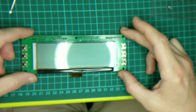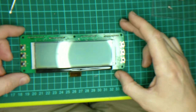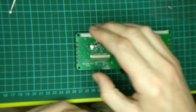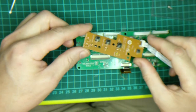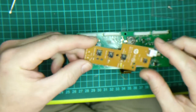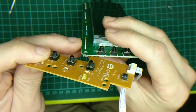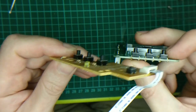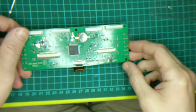So the screen is normally this way up, so this is the dodgy enter button — the one you end up probably using most. It goes and dies first. Anyway, I've got some random old circuit boards; this one's out of an HP printer. We're going to take the buttons out of this and see if they're the same as the ones in this. They look pretty similar to me — maybe the depth isn't quite right, but we'll find out. Let's take one out first.